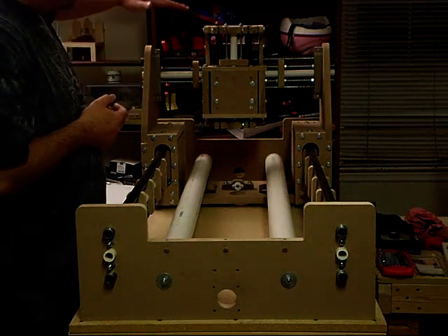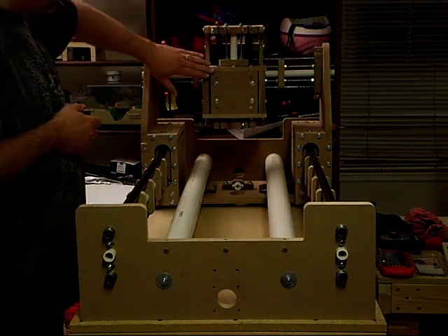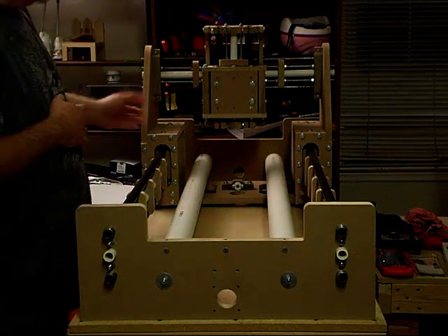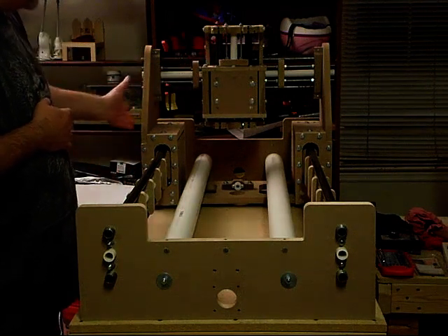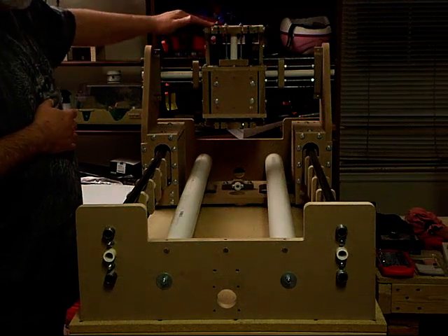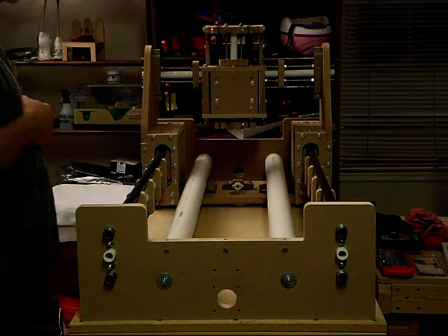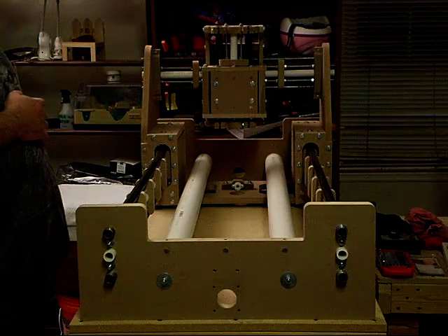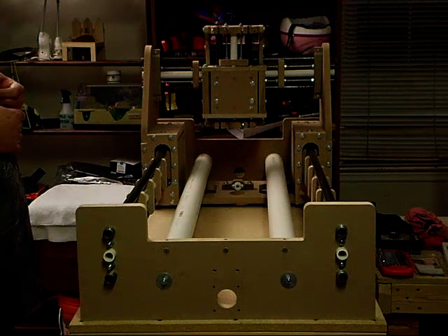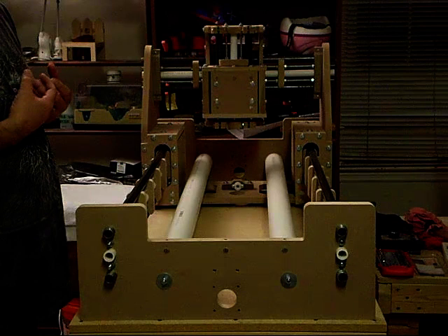On the previous machine I had made a 9-inch separation between the rails, but I did away with that to simplify the design. Everything is based from this original design, which is a simple rectangle — basically this shape without the lip or the leg — so it is adaptable. I started with that, added this lip, added this leg. On the Y carriage I made it longer and curved it around so I could lock in the top and bottom plate. You can see photos of that on growthygeek.com — I have about twelve photos of various pieces posted, so please go look there for a better look. It is a very modular design, and hopefully this will allow me to continue to tweak and modify the machine, or possibly design new machines without having to reinvent the wheel.